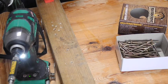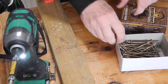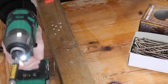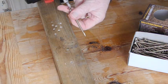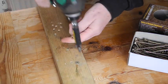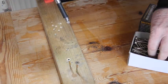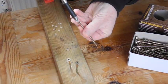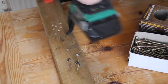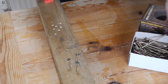I like to have the choice of using a drill driver or an impact driver to drive screws, and in this particular case I think you'll find that it doesn't make any difference. In fact I think the drill driver is a little bit quicker, but with the impact driver you can see it's pretty damn quick, and the hammer action barely comes into play.